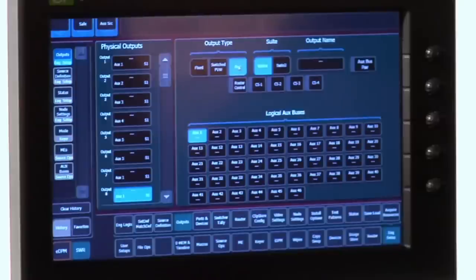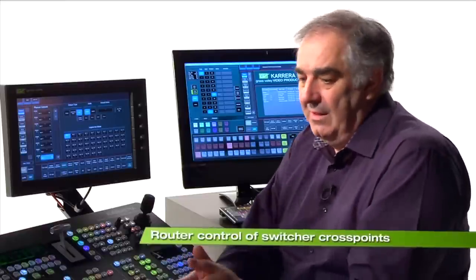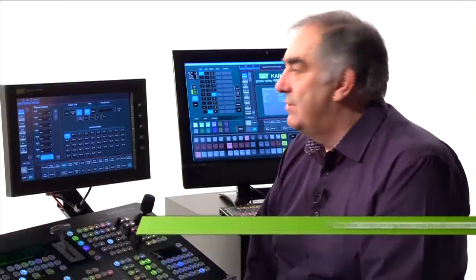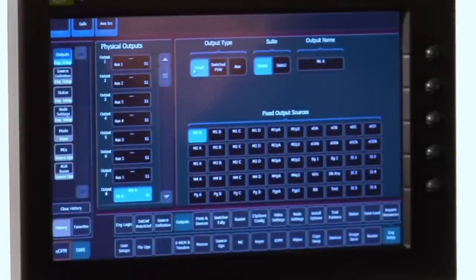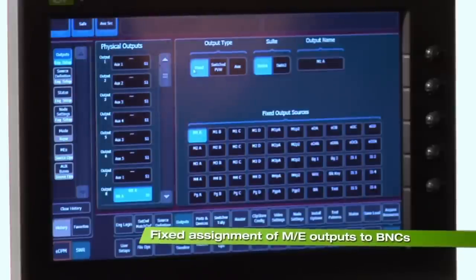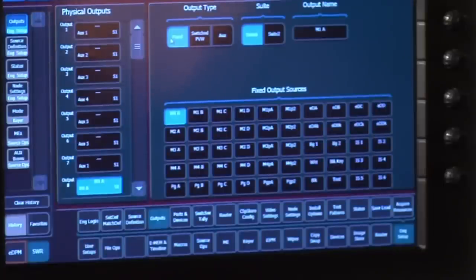What we're really trying to do is make studio design that much easier for our engineering designers. I can also give away control of my aux buses so that the Grass Valley router control system can take control of aux bus two to expand its own size if I'm not using all my outputs from the switcher. The last kind is fixed output, which our studio designers really want to hear about — they can get to all the outputs of all the MixFX banks, including eDPMs, and fix those to BNC outputs so it's easy to guarantee program preset and clean feed outputs on guaranteed BNCs.